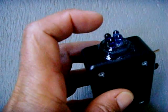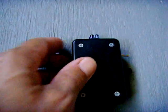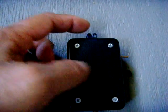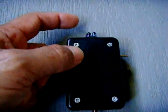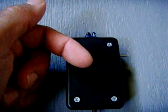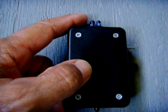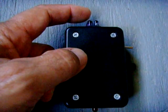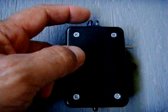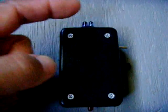The reason I use four LEDs is to put them all in parallel to get more sensitivity, and each one is slightly angled outward. All four IR LEDs are connected in parallel and reverse biased. When you look at the schematic, the positive goes to the negative, and then to the base of the transistor. When light shines into these LEDs it allows current to flow through into the base of the transistor.